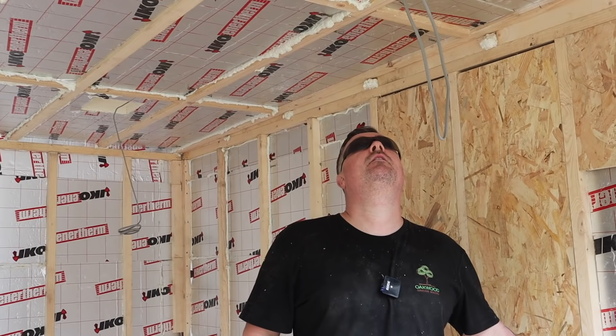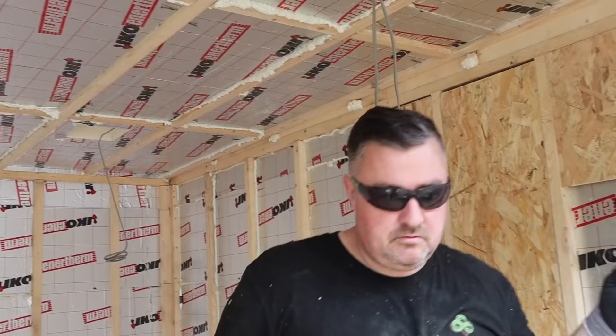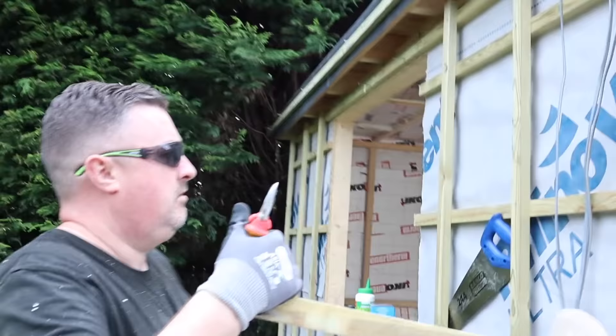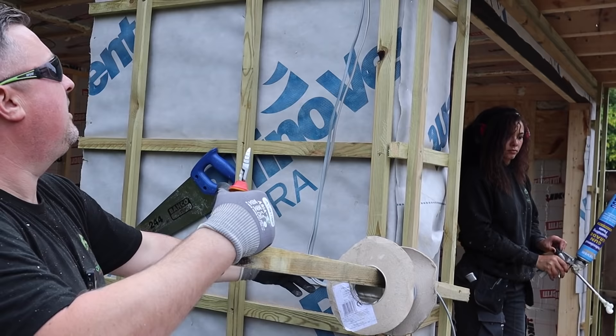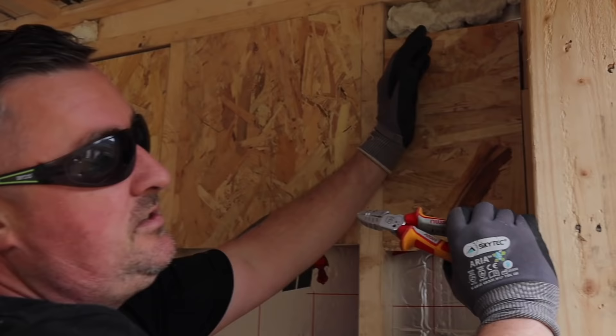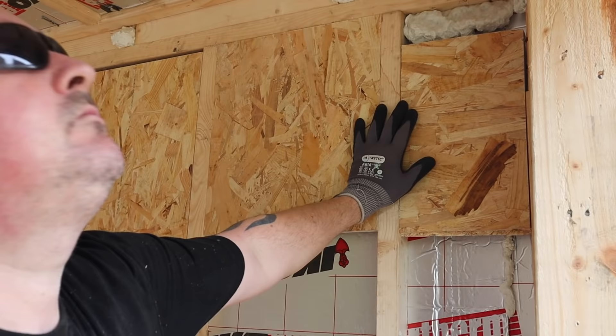Leon wants me to go through more electricals. I've done the lights and explained them yesterday. Where our light switch is going — once we've plasterboarded I'll drill out and feed the cables in. I've run a feed from there to where the consumer unit's going, through the joist all the way across, and left my wire ready. For the front we're going to throw some canopy lights in — just a daisy chain between them, equally spaced.